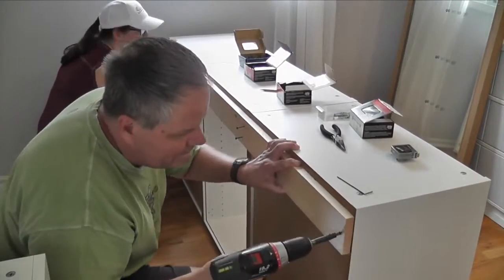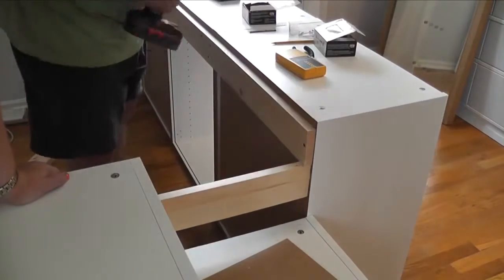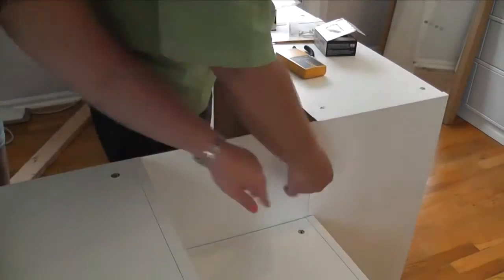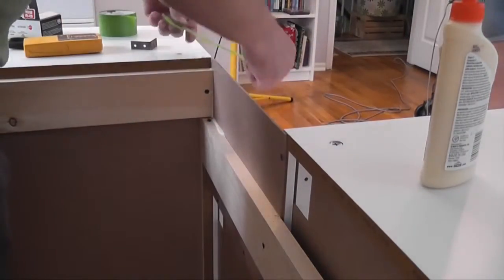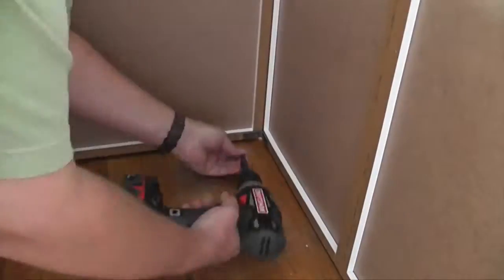I installed another framing board on the back of the cabinets, and used a piece of the unused back to fill the space next to the steps. A little glue on the back will keep it in place where I don't want a visible screw. A small angle iron ensures the corner stays together at the bottom.